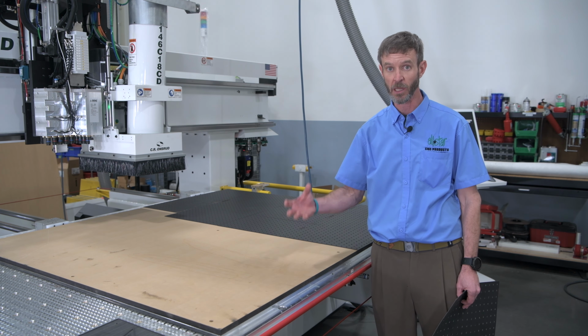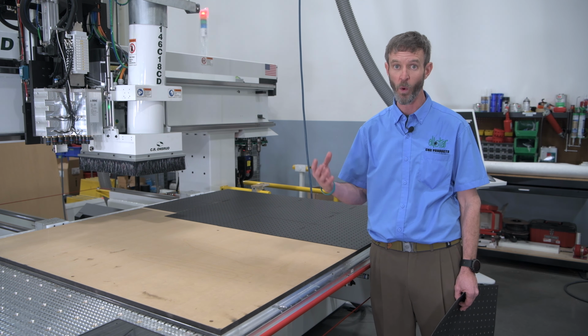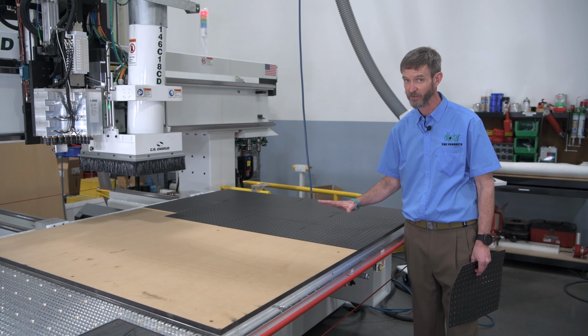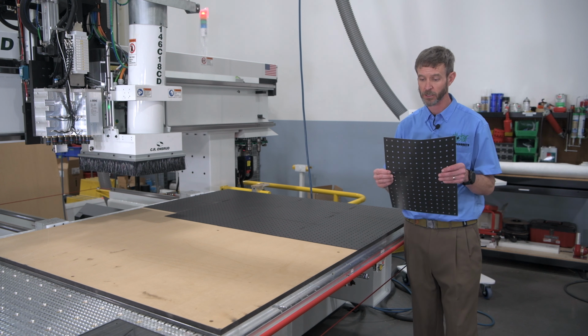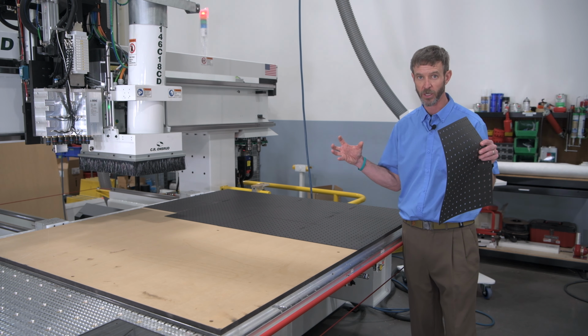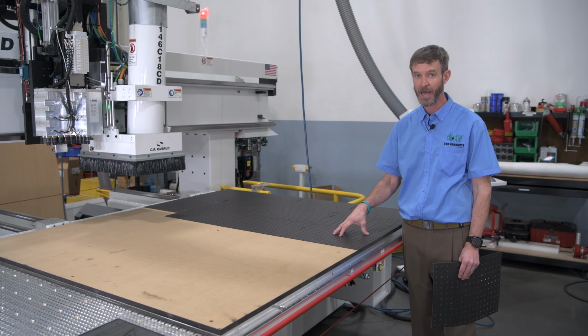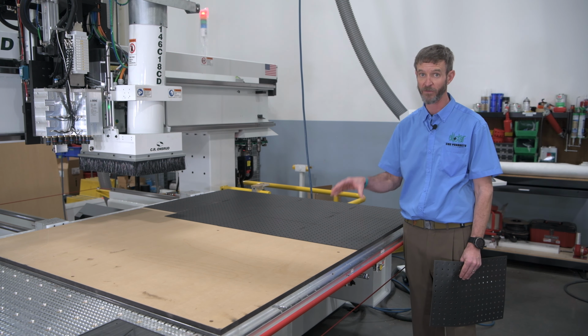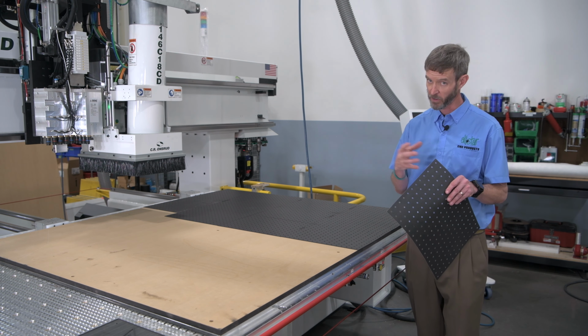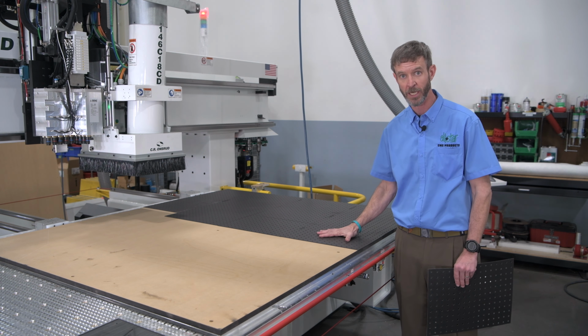But what that also does is allows a lot of leak, a lot of draft, a lot of wasted vacuum pressure. When we cover that same MDF spoil board with these tile gasket products, quarter inch hole every 1 inch, what that does, it takes all that vacuum pressure and concentrates it to these holes and allows for maximum vacuum performance, maximum vacuum clamp, because we have a closed cell item creating a seal, creating a clamp, a lip of the freezer door concept to hold onto that sheet as we cut.